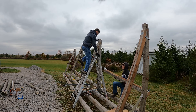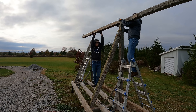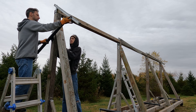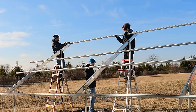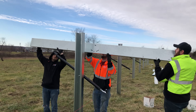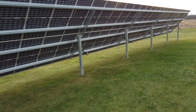A through bolt at the bottom and a heavy-duty lag bolt at the top makes for an incredibly rigid structure. The only thing lacking is some lateral support, and later I'll add diagonal braces to improve lateral stiffness. A friend gave me some scraps of galvanized angle iron for the center mounts, and I'm using short sections cut from heavy-gauge inch-and-five-eighths galvanized unistrut for the east-west purlins for the end brackets. I know that this galvanized strut can span at least nine feet — that's what I'm using on my main array engineered for 90-plus mile-an-hour winds. To make the array tiltable for the seasons and for easier access to wood, I'm using jacks from Sinclair Racking — a system I recommend on my website. I have no affiliation with them, but it's a really great system.